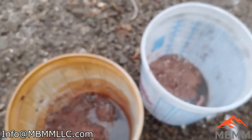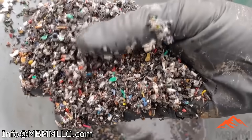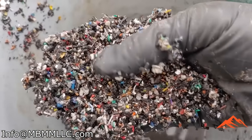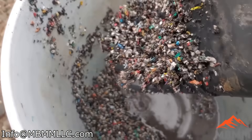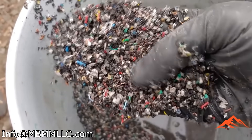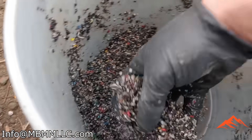Let's take a look at the number three as well. Here's the number three — this is mostly insulation, but there's still some copper in there. I think this is a table tuning issue where you had some copper going down to the number three, and you could take care of a lot of that by getting the plastic spread out just right and cut to the right shape. There's hardly any here. You could take this and rerun it with your second batch. So you can really use the middlings as a catch-all and then rerun the 5% that comes in here at the end of the day. This isn't lost copper — you just have to reprocess it or get the table tuned up a little bit better.